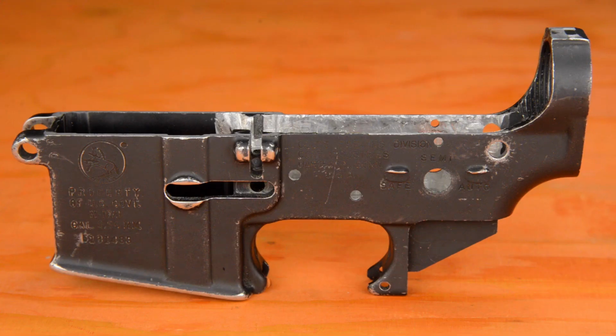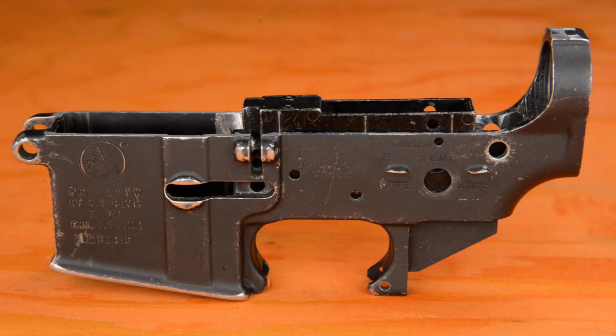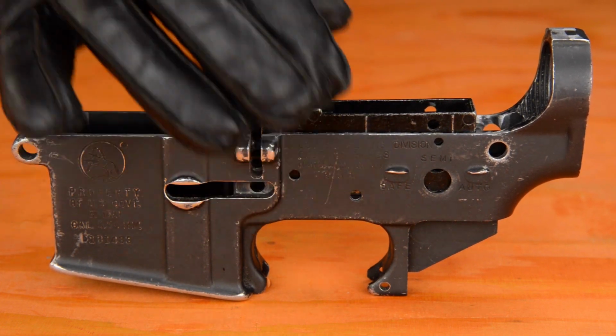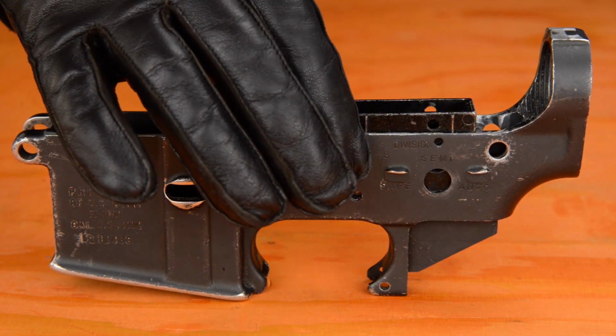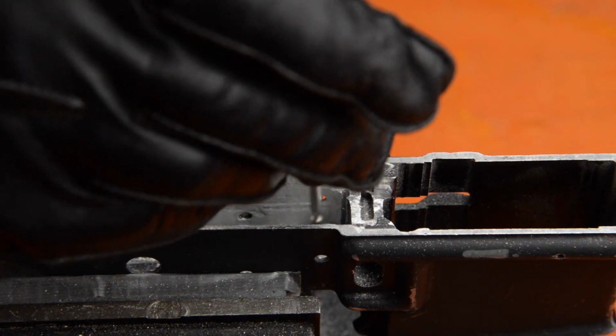Even though I removed too much material, the trigger group still does not fit, since the mill is round and the corners are square. I use the same technique as before, and drill away material from all 4 corners of the trigger housing. Then finish off with the Dremel.